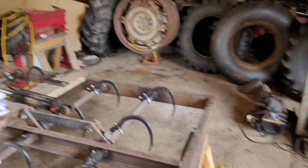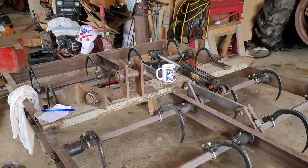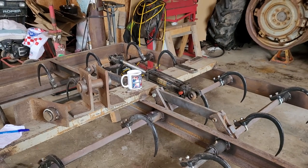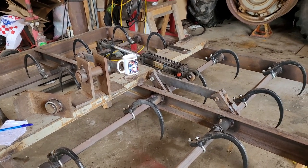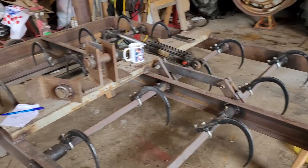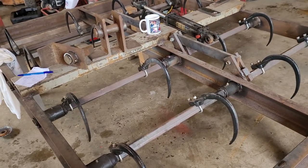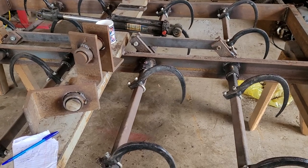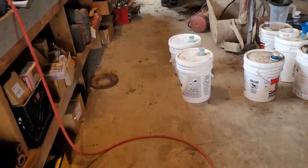I've got to drill holes in that other piece of channel iron to bolt it. I want to make it so you can change the belt. The bearing should hold fine — that's why we're putting that big bolt in. If it ever lets go it can't go any worse. That bearing is off a three-quarter ton Dodge truck so the front ends are quite heavy. Eight bales of hay isn't a ton anyway. I looked at different things but I had this bearing and it was actually good, so I'll try it. With that big washer, if it does let go it just can't go anywhere.